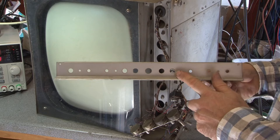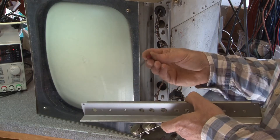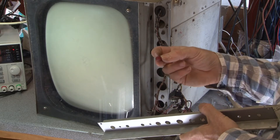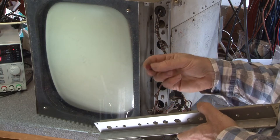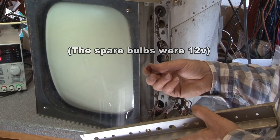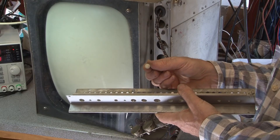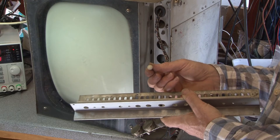So the next job is to clean this up. The other interesting thing was that the on-air light was actually okay for this monitor, and it is a 28-volt type as specified in the manual. The ones Brian sent me may have come off something else, or maybe it was a customer choice when buying the monitor as to what voltage bulb was used for the cue light. I won't throw away the blown mains light because where would you get another one of these?